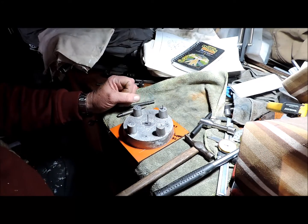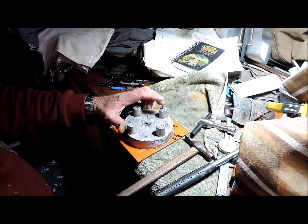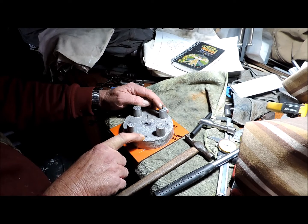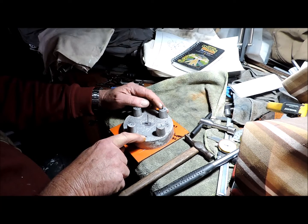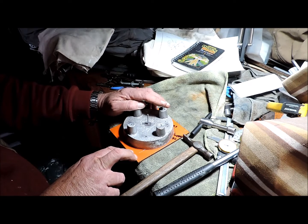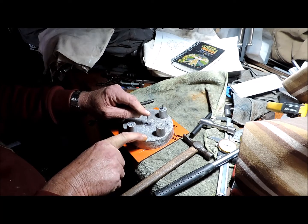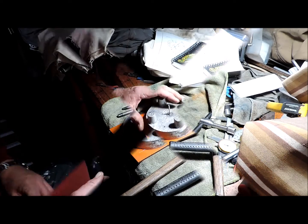That's it there, so it lines up. We're in the right place. I'll go and drill this one through so I can use this 3mm to peg that in place. Then I will come back. These are supposed to be M8, but I'll make them M6. There's four of those, but I'll do one first: drill it, tap it, counterbore it, countersink it, because I'll be using M6 countersinks. Better check my inventory. And then I'll have a fixed position and a centre peg. I can then go around and drill all the other holes. So let me do that.